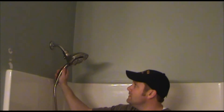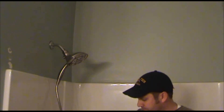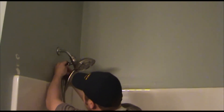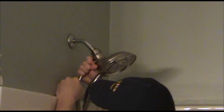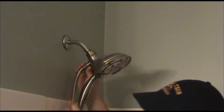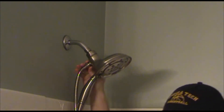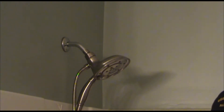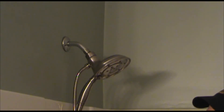The handheld itself fits up into the shower head, clicks in, and the other end fits on the shower head itself. This one has a rubber gasket as well, but I do recommend it be tightened with a tool. So that you don't scar your finish, you can just use a pair of pliers and an old t-shirt — just drape the old t-shirt around.